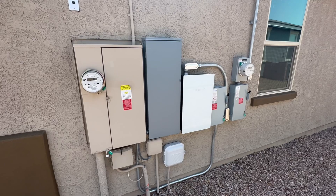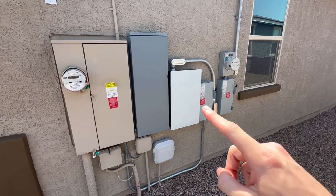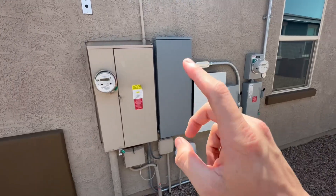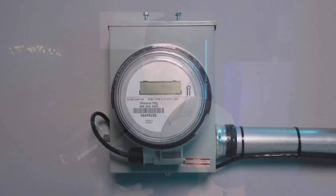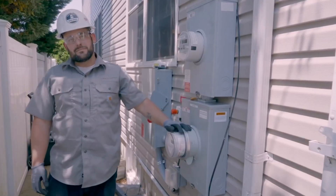If we go with the standard gateway route, this is traditionally going to require a bit more electrical work, circuit relocation, and a larger equipment footprint. But it will offer a little more flexibility since you can select which circuits you want backed up. Now, if the backup switch offers a simpler installation, why not use it every single time? First, since it's a piece of equipment that goes behind your utility meter, not all utilities have approved of the backup switch.